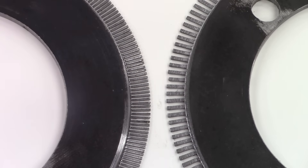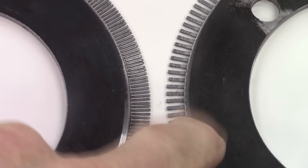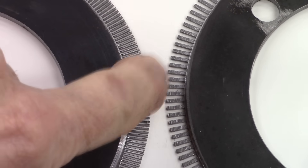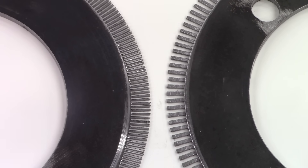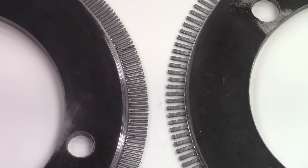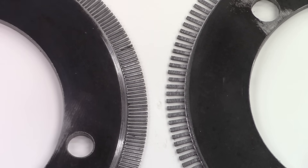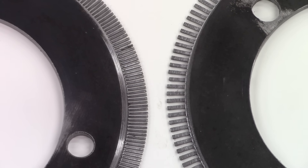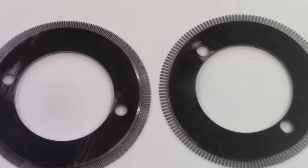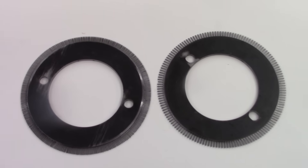I ended up remaking the disc with 150 notches. I feel better about the quality on this one, although there was one little hiccup — a little short tab there. I think it'll be okay though. I was a little worried about the quality of the notches on the first one; some of them varied in width a little bit and I was afraid the encoder wouldn't pick up well. I'll put the links to Andy's Machine in the description. He did an excellent video on how to build the gear hobber and I encourage you to watch it.